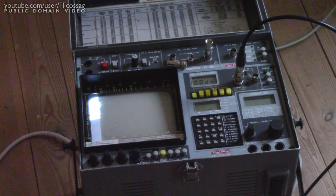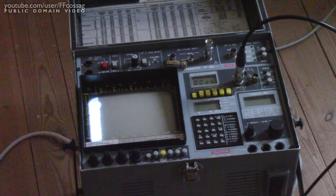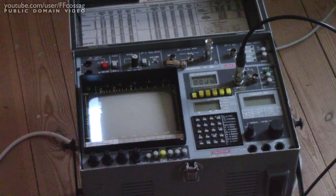Since I'm a bit of a nerd I also had access to this old spectrum analyzer, which I'm going to use to demonstrate that this in fact does work. Before we do, I want to put a disclaimer in here: the 4G network in my area is running on 800MHz, which is in fact also a TV band. Often in more urban environments 4G runs on well over 2GHz, much like 3G, and in that case you're unlikely to have any success using an old TV antenna because that's just not the TV band.